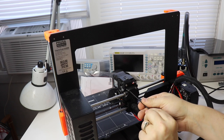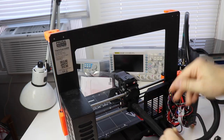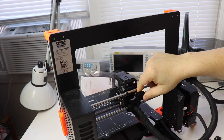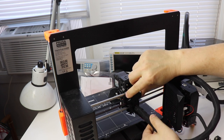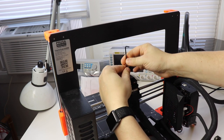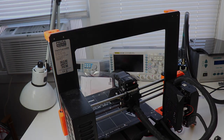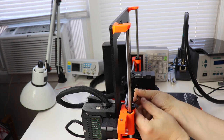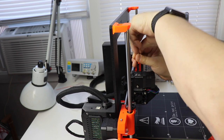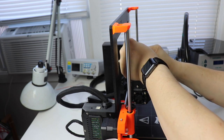There are four short screws on the back of the filament sensor — you'll want to release all four of them. Once that is done, move this plate back about one centimeter; you should be able to move the wires a little bit. Next, remove the filament sensor cover by removing the screw first and lifting the cover off. Release the idler screw but you can leave it in the extruder for now. Next, remove the screw from the IR filament sensor, unplug it, and set it aside — make sure to keep it safe because you will need it later.